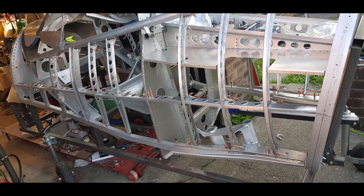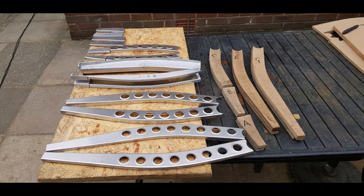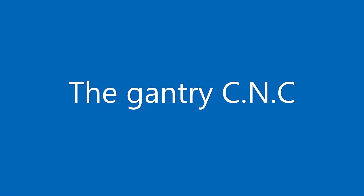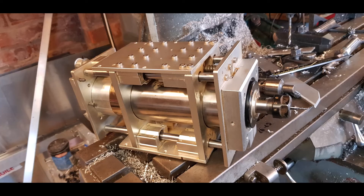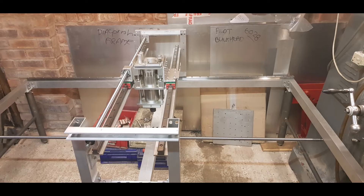The manufacture of the contour frames and intercostals was a conventional process, utilising wooden formers and bolsters to produce the skin attachment flanges and the double return inner flange. The Whirlwind Fighter Project workshop is equipped with a large open gantry CNC machining centre, which makes the manufacture of the large number of accurate frames at least tolerable. It can truly be said that for every prototype metal aircraft made, at least one and a half wooden ones were produced, if only to be used once.